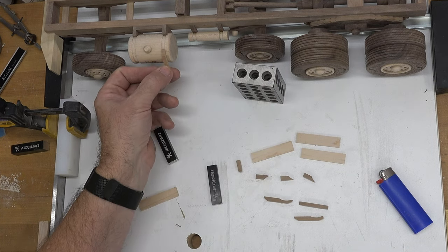So guys, the setup for these and the glue up does not have to be difficult. A little bit of setup with some setup blocks here and a straight edge can really make your life so much better and so much easier. So we know that the steps overhang from our brackets or from our mounts by 1/16 of an inch. And we can get that measurement by scaling off the miscellaneous drawing 121-5, which is drawing 5 out of 9. We can scale off that. We see that it overhangs here 1/16 of an inch.